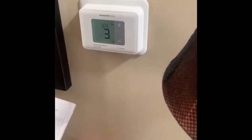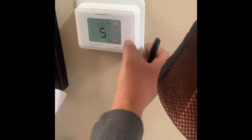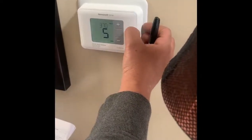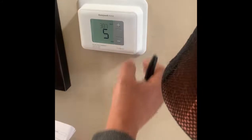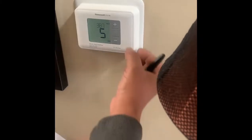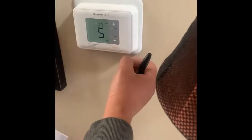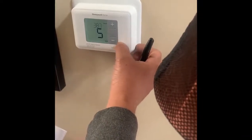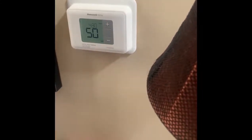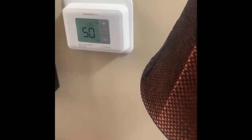Compressor cycle: three. This is factory set, leave it like that. Setting 370 is heating cycle — five times in one hour, which is fine. That is the required compressor protection: it controls how many minutes of delay once somebody sets the temperature, which is five. That's to protect the outside compressor from overload or trip.